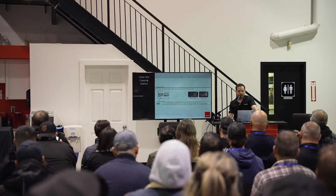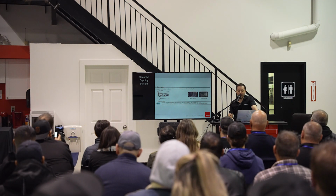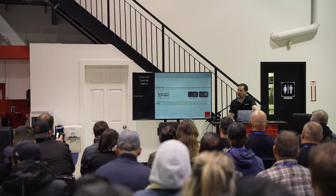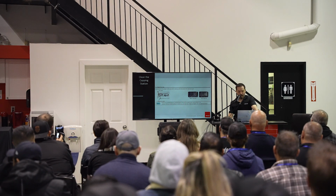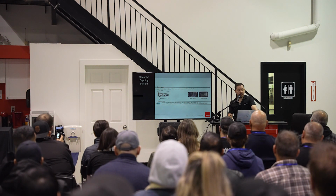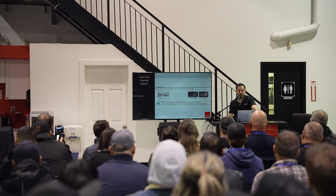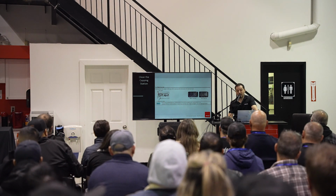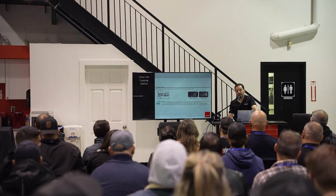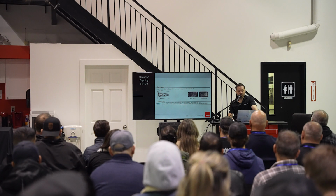All right, and this is a picture of what a dirty cap looks like compared to a clean cap. We've got a lot of buildup, a lot of ink sitting in there, and the difference between a clean cap. I recommend to clean this with a TxF daily. Every time I'm going to print, if I have a buildup there and I run that purge, I get a lot of dropout. It's really important, with this type of ink, the viscosity thickens pretty quick and it will cause issues.